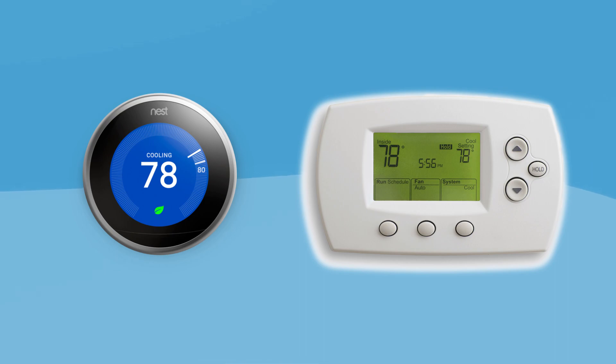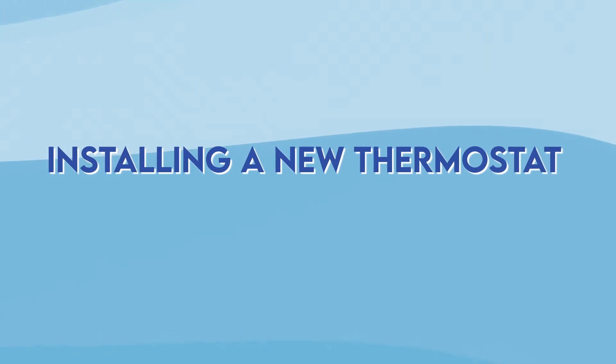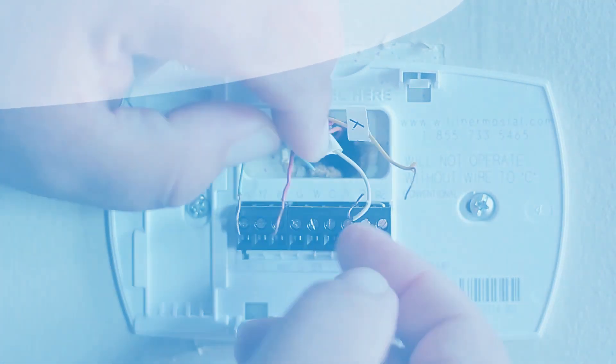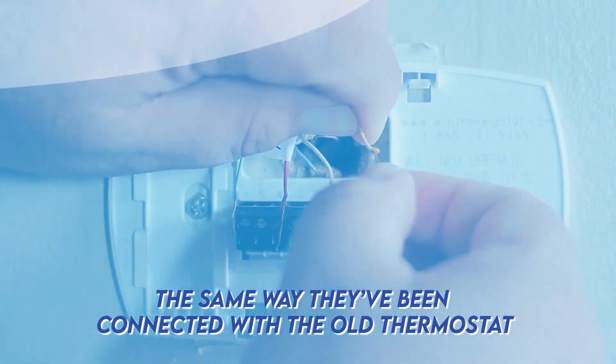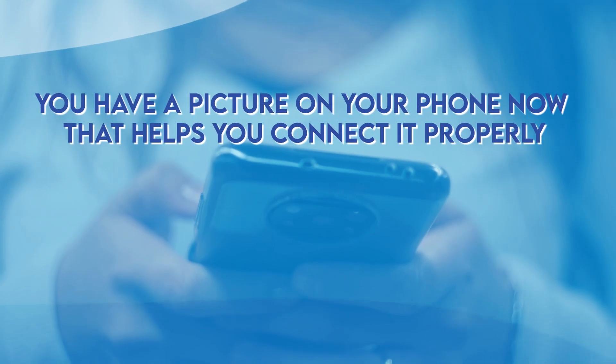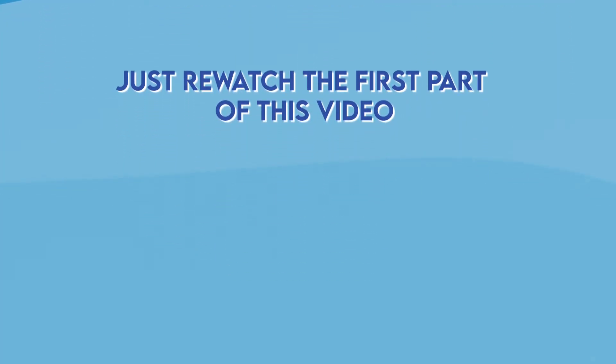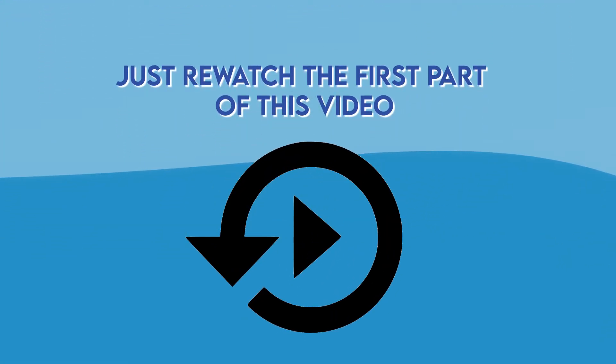By this time you should be able to remove the old thermostat. Now we come to the more interesting part: installing a new thermostat. With the new thermostat in the exact same position as the old one, start by reconnecting wire by wire the same way they were connected in the old thermostat. Luckily you should have a photo on your phone to help you connect properly. If you didn't take a photo, just re-watch the first part of this video where we explain all the color codes you need.